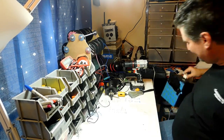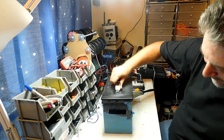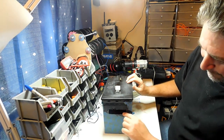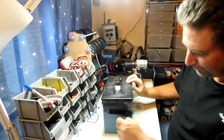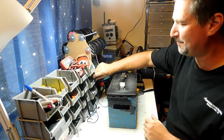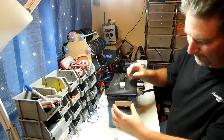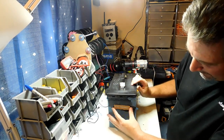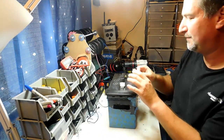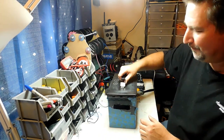This is not the cleanest hole I've ever done. I used it to cut this hole out right here for the FM transmitter that's going in here. I'll show you guys a little tip: take a piece of cardboard and make a little template like that to trace around, and that way you'll get the perfect size hole that you need.